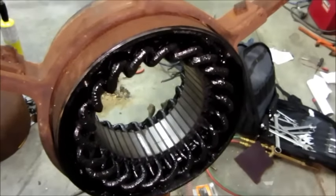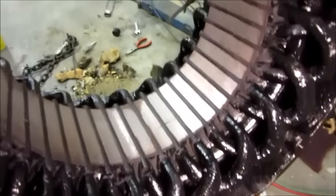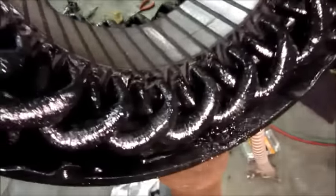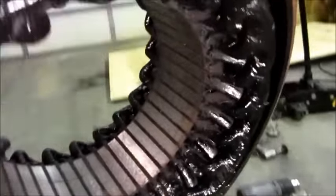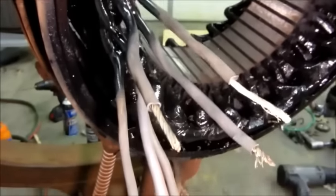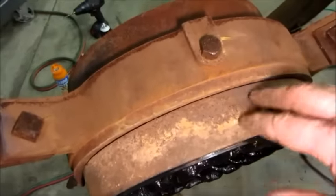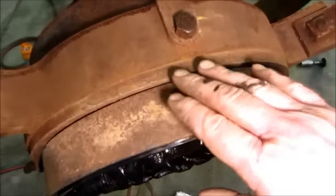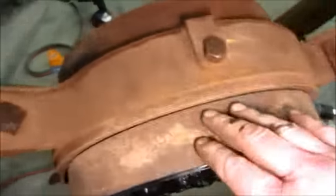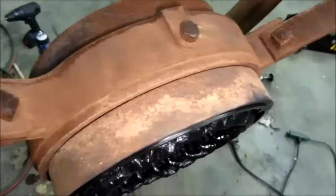Got a little update on the 48-inch ILG. I have cleaned up the mud dauber and wasp nest and put a fresh coating of varnish onto the winding and it's looking good. My plan is to get the motor internals done, put it together, and then paint the outside. The motor itself is black — this part out here and the end bells — and the rest of it is green. It was probably that Japan black they used to use.